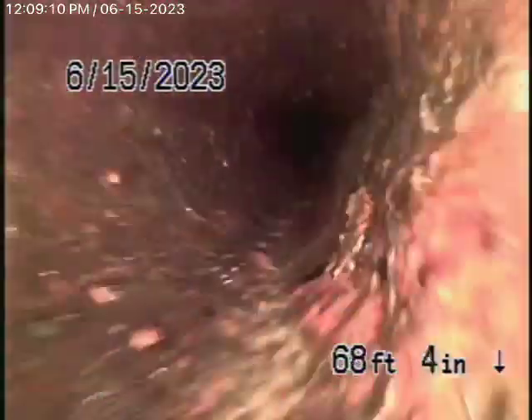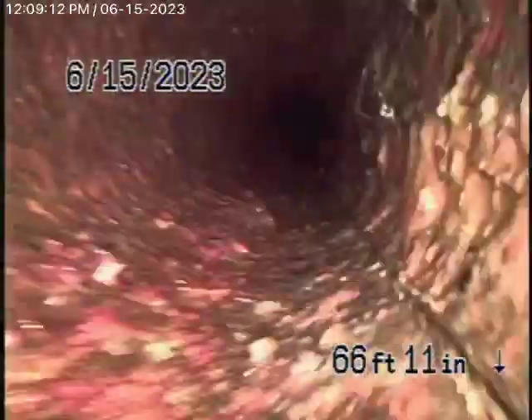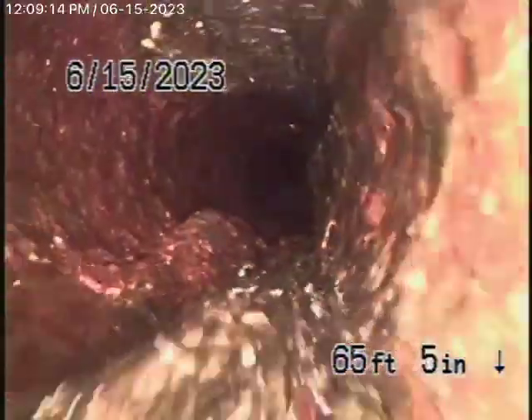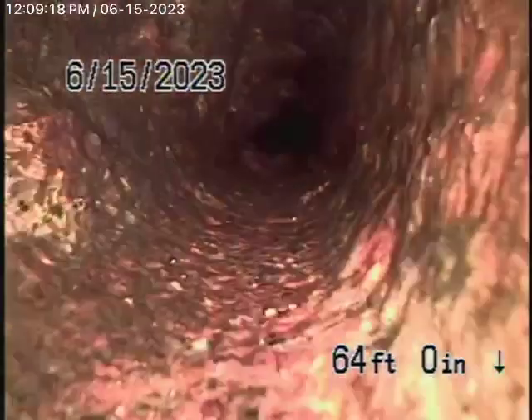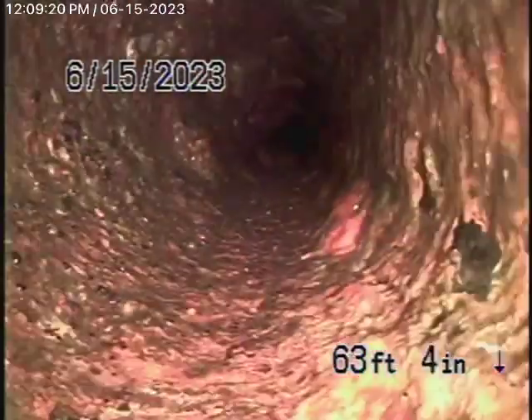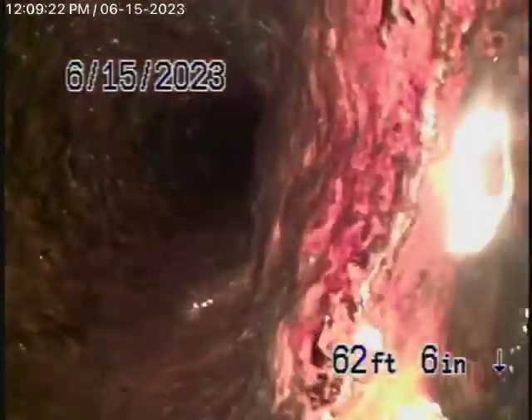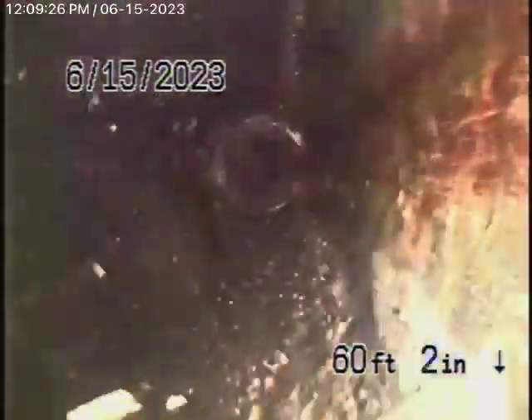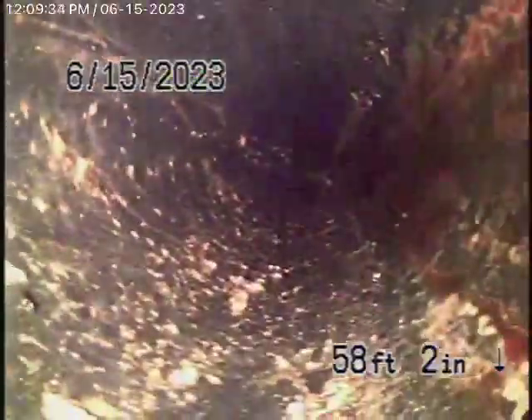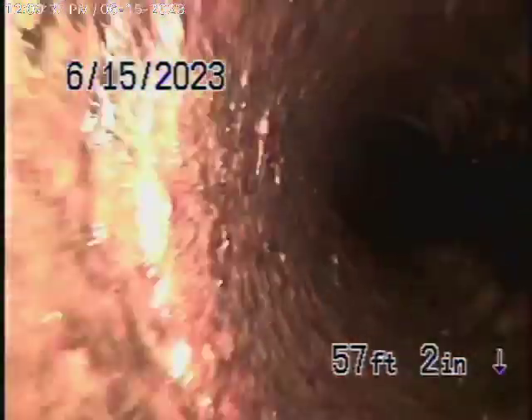As the camera comes back, we're coming onto the property now. This sewer line has a very good grade going downhill, but you can see roots are getting into the cast-iron pipe already, so it's pretty much compromised. You can see there have been little sections of pipe replaced with ABS plastic — those were obviously little repairs made along the way. It goes back to cast-iron pipe.